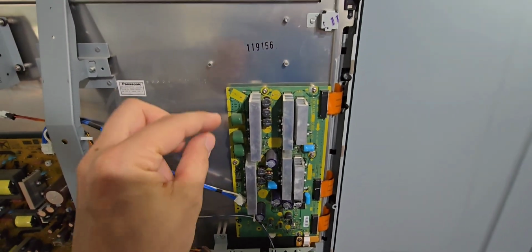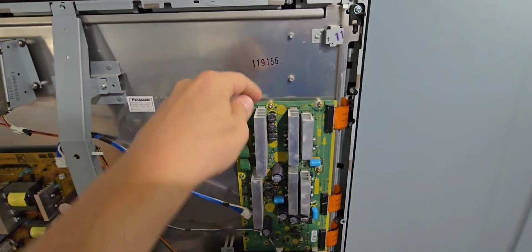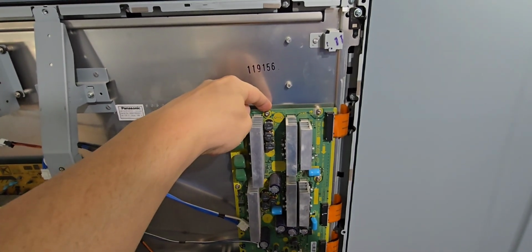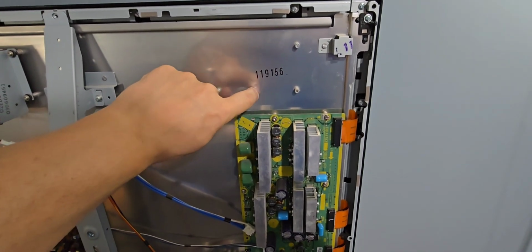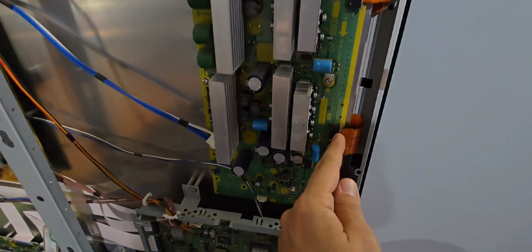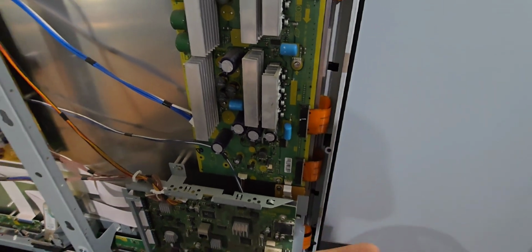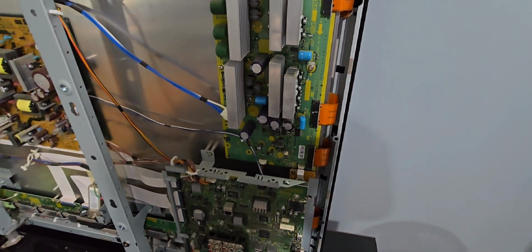Now, what I did was I loosened them up. I sprayed some contact cleaner there, worked it back in, and made sure it was a nice dead connection to ground, which is your ground plane. And, you know, reseated the connectors. You can actually pop the little silver piece out here. These ribbon cables then become loose, and then you can clean them out that way with contact cleaner.